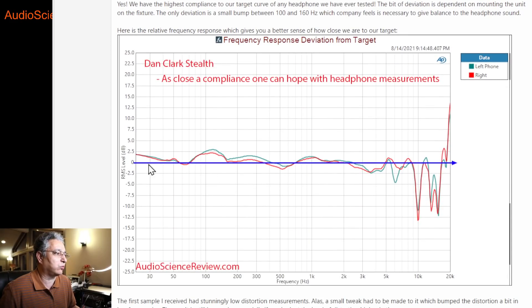Most startling is to look at this as a relative curve. If you subtract the frequency response from the preference, you can see how closely we hug the zero line. You try to find a speaker that's flat to 20 Hz and below — you're not going to find any reasonable speaker that goes that low — yet we're down there and then some. Yes, we have one or two dB here and there, but remember the measurements are approximate. This cancellation always happens because of the measurement fixture — it's just the nature of the animal. But overall, it's just extremely close to our target response.